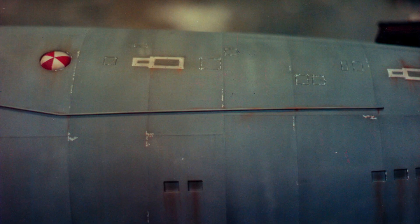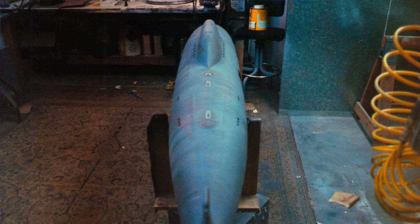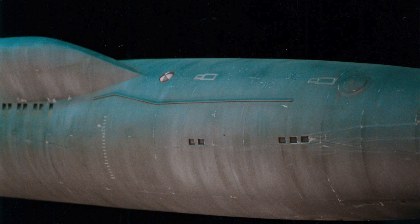Four inches out of a 48-inch model is kind of a problem, because the sub isn't quite a cigar — you can't just cut two parallel lines into it. The damn sub does this — it tapers. So you're not only cutting this way, you're cutting it on a cone, not a cylinder. I got that job. And because it was fiberglass, you're using these little X-Acto saws, burning them out, getting a new one, then putting it together. By the way, that mold was trash, because you can't cut the mold four inches out and put it together. Start over.